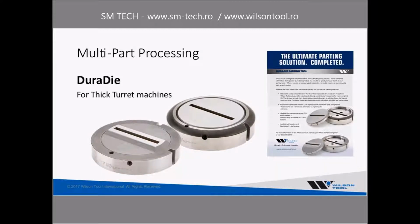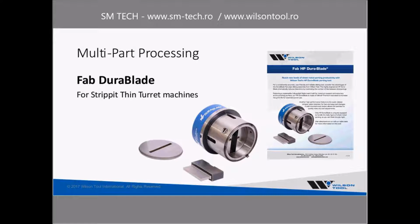We also have a kind of a matching die concept that goes along with that Durablade punch concept. It's a die body with an inserted powdered metal insert that's much longer lasting than standard dies. Back looking at the punch again, we make a design similar to what we make for the thick turrets. This design is made for thin turret machines, strip-it style thin turret machines.